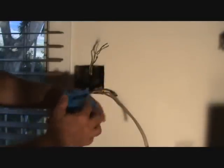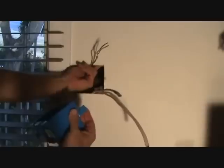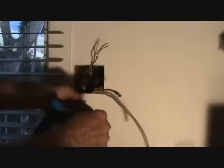I forgot something. Before we put this box in, I want to make sure I have enough clearance right there. When this flap goes up, there's got to be enough clearance so that it grabs on the backside of the sheetrock. You might want to check your sheetrock because it might be 5/8 inch instead of a half inch, or it might be some other thickness if you're doing stucco or whatever.